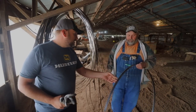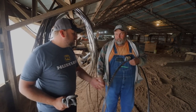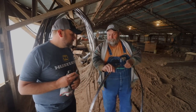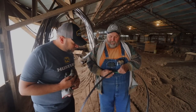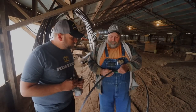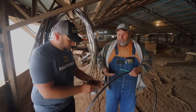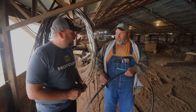My first question that I wanted to ask you is, can you tell by looking at this if it needs sharpened or not? Yeah, here's the way I was taught to do that. Use your fingernail. Drag your fingernail across the tip of it the same way the wood would go. And notice how it just slides. I'm putting some pressure on it. More. And it still just slides. So it is some dull. Not that it wouldn't cut. Does it dig into your nail? Not really.